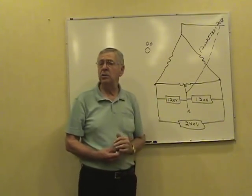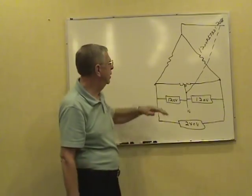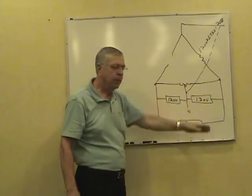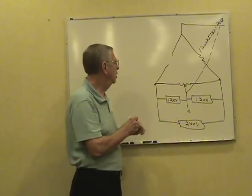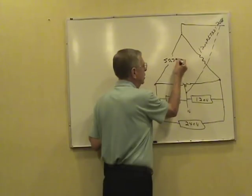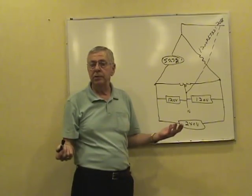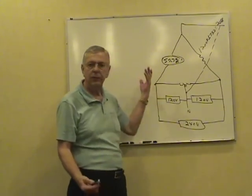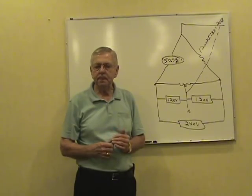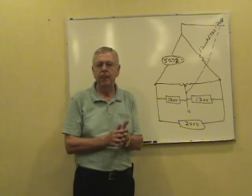And one advantage to the delta high leg system, the delta three-phase secondary: if you lose a transformer, maybe a winding's burned out, you can still keep a portion of the three-phase load operating with only two transformers. It operates not at one-third, one-third, one-third, but at 57.7% of the total of the transformer. Maybe it's a 300 kVA transformer. You'd take 57.7% of 300 if you lost a winding. Also, it's sometimes put in as an open delta system, where you can get three-phase out of only two of the transformers. Okay, now,